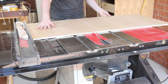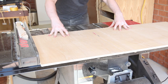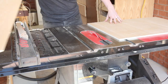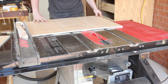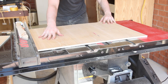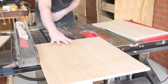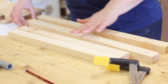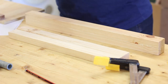I cut the 12mm plywood for the flip-top sandwich. This time we're using poplar ply which is overkill, but that's what we had on hand — on the Mark I the pine ply hasn't had any issues. For the bracing of the sandwich we decided to add a third member, so rather than cutting something else down we just glued up all the offcuts to get the 56mm needed.